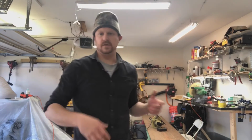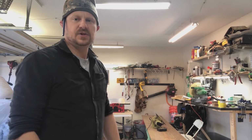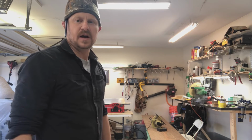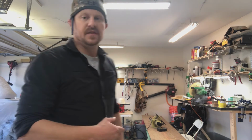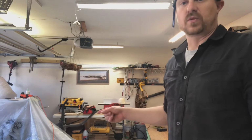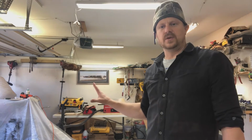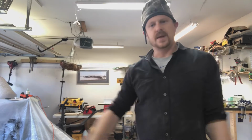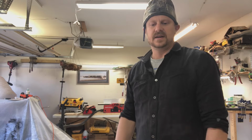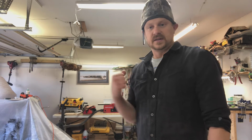We're set up out here in the garage. I've got everything set right here. We're just gonna quick get a straight edge set on that and run my circular saw across that. We're then gonna route that edge. Then we're gonna move over here to the router, to the joiner and the planer. And when we're at the joiner and the planer, what we're gonna be doing is milling down that cedar so it's uniform. And I'm just gonna nail that in all the way across. I'm not even gonna join it, butt it, anything like that. It's really decorative and it'll be fine just sitting back there. So let's get going.